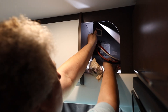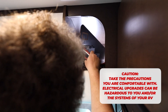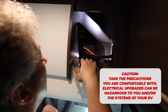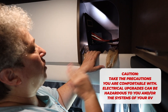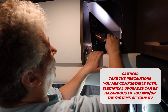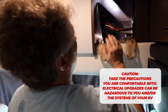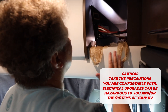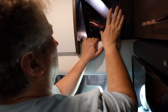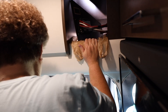Now, if you're careful, you don't really need to disconnect the solar power or cover up the solar panels or anything like that, because you're just dealing with one positive wire. But if it's a sunny day and you're a novice, you probably might want to cover it. That's always the safest way — cover your panels or do it in a covered area so the panels aren't producing power, or do it at dusk. The comfort level is up to you as to how much voltage you're willing to risk. The real risk is just that you don't touch that hot wire to anything metal, because then it will ground. There isn't really anything metal here — this is all wood — but you always want to be careful.